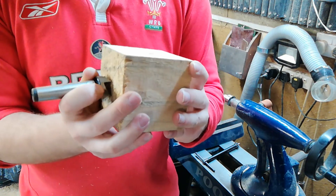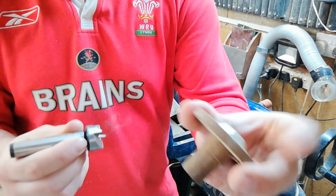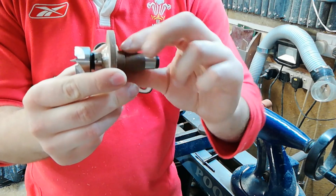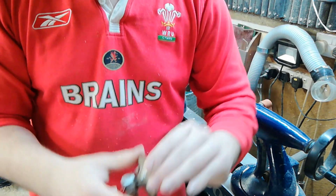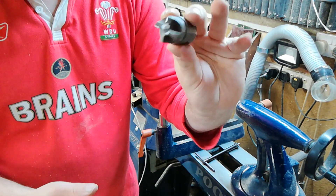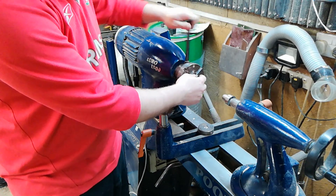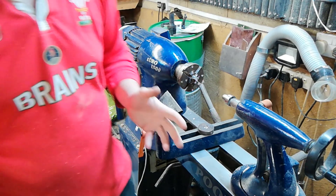To save a little bit of time not changing over the chuck, there are a number of things you can do. Number one, you can purchase one of these adapters so your chuck jaws grip over it — it's a perfect two morse taper to hold it in place. Or you can get smaller spurs and drive centers that your chuck jaws can clamp onto, and that's what we're going to be using today. That speeds up the time between turning so you're spending less time removing the chuck and more time turning.